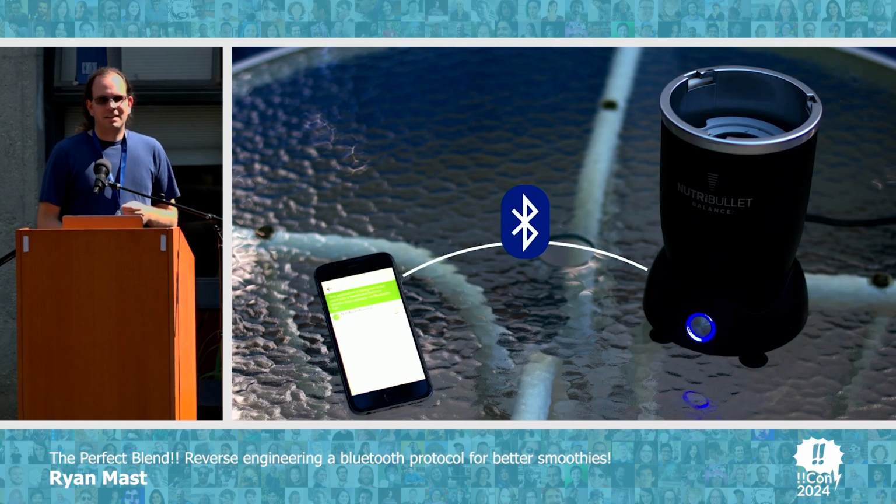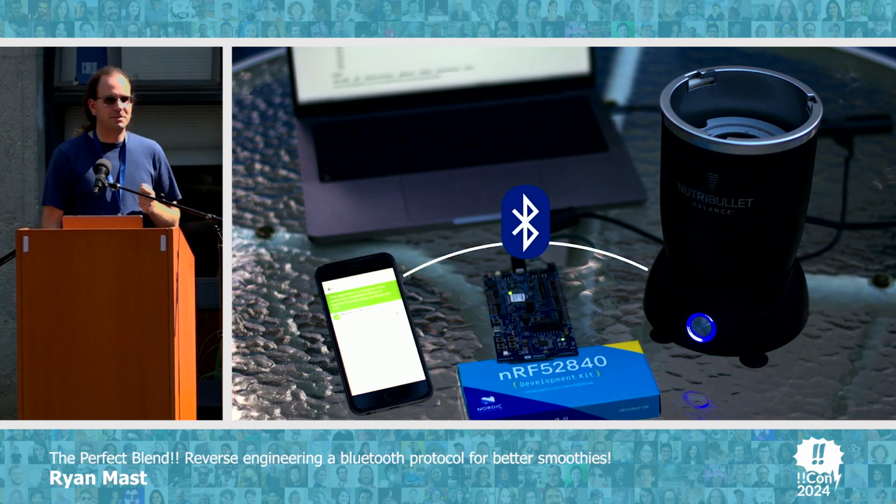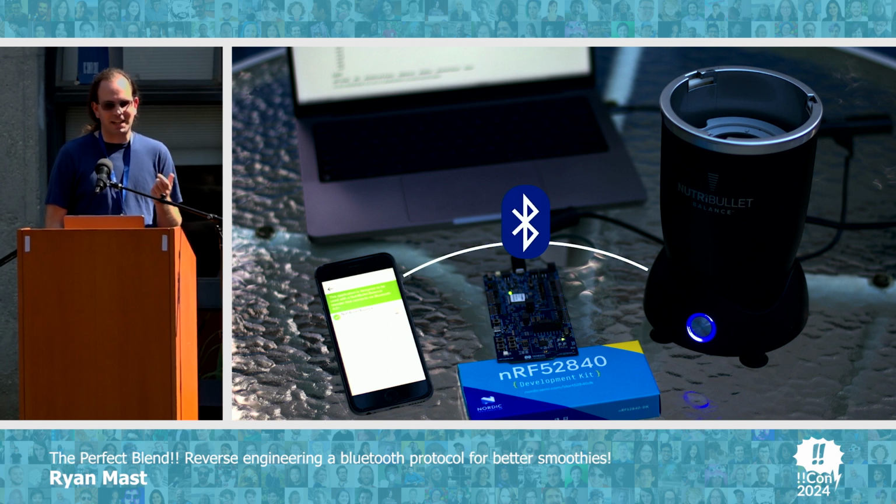So I want to capture what data is being written to the blender, so I need a way of intercepting the packets. The first thing I tried was taking an NRF52 development kit, installing BLE sniffer firmware on it, and then intercepting the wireless transmission between the two devices. And this worked. I was able to capture the packets in Wireshark.